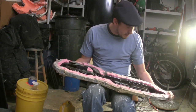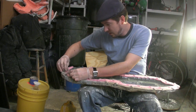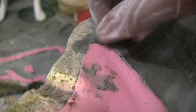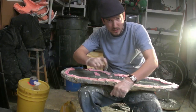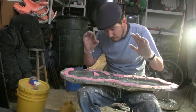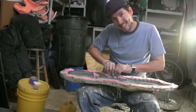What I'm doing now is trimming off and peeling off some of the excess material around the edges. It's going to make the two halves of the mold fit together more snugly and more flush, so you don't have any leaking plastic coming out of the edges. If you've got leaking plastic, you've got a big problem — you're going to waste about 20 bucks worth of plastic all over the floor. So save yourself time, money, and pain by peeling some off the edges.